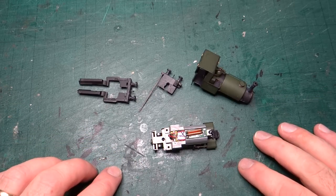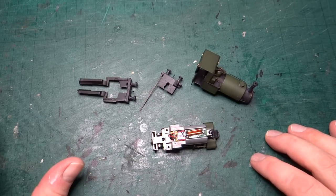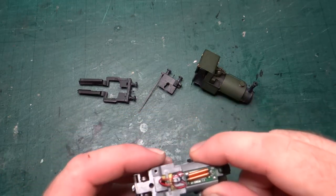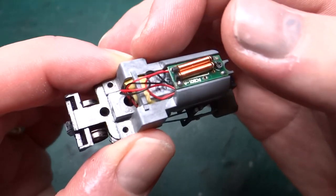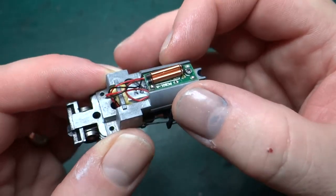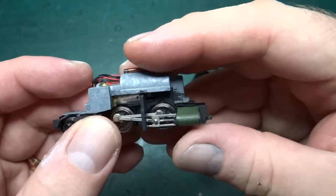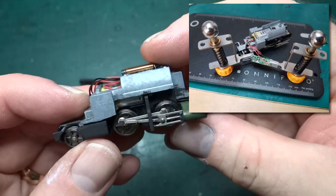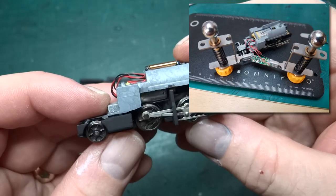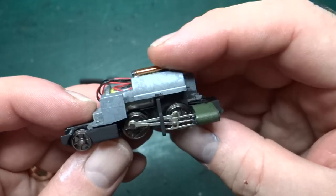Today we're almost at the point of being able to fully reassemble this. Pretty much everything's painted, and we'll go through exactly what we've done. First thing I've done is I re-soldered on the wire. If you remember last time I pointed out that one of the wires had come loose from the soldering on the circuit board again. So I've re-soldered that back on and used the OmniFixer again to hold everything.